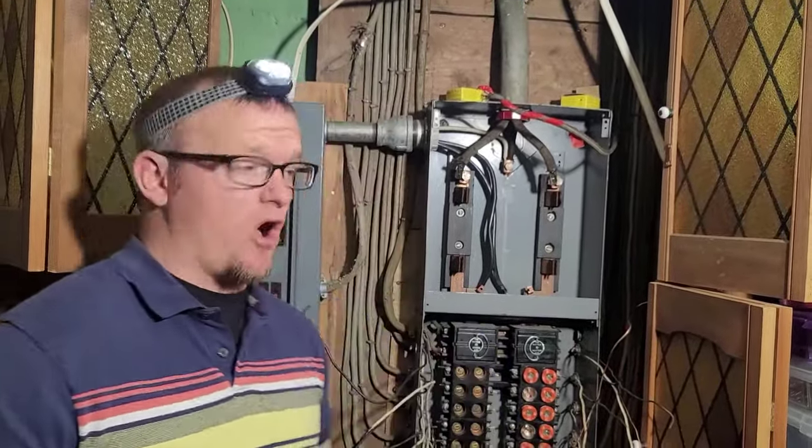So what I'm going to do is knock out this two-inch hole, get our panel mounted, get our new big wires pulled in, and then I'll be able to start working the branches in. You're going to fish these wires back through the holes and either use these lock rings or use a connector very similar to this. Let's get ready for the next phase.